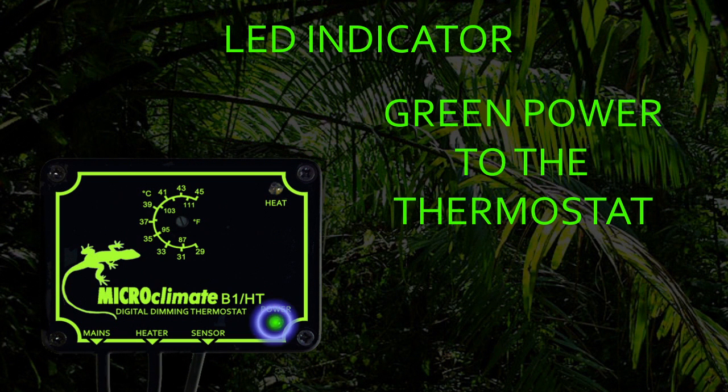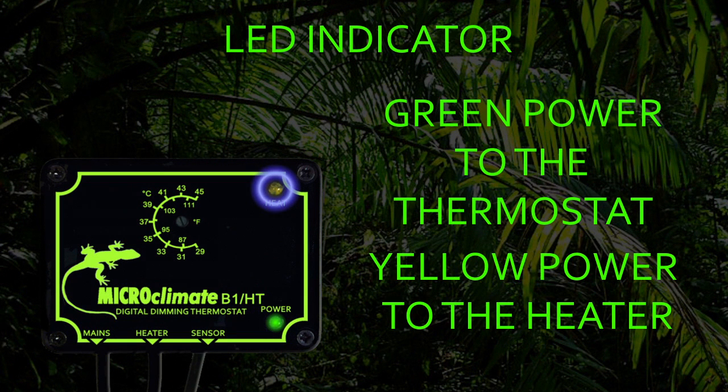The green power LED on the thermostat will be lit when the thermostat is plugged into the mains. The yellow LED allows you to see how much power is being sent from the thermostat to the heater. It will be full brightness when full power is being sent to the heater, and dim accordingly to represent the power level being sent to the heater. When no heat is required, the yellow LED will be off.